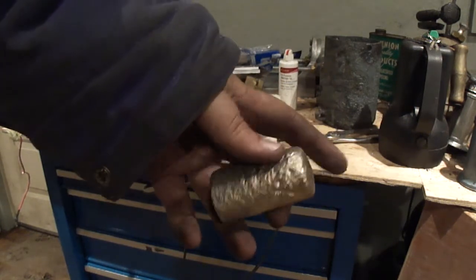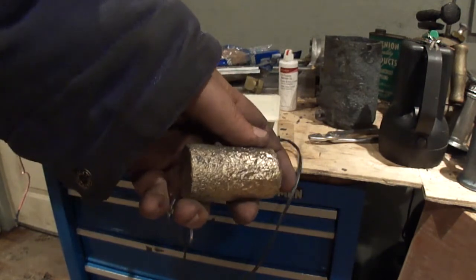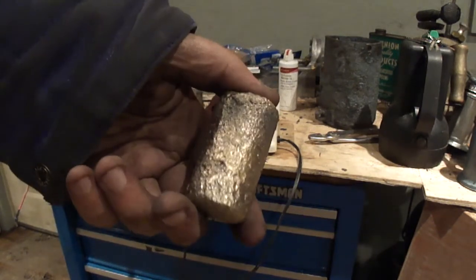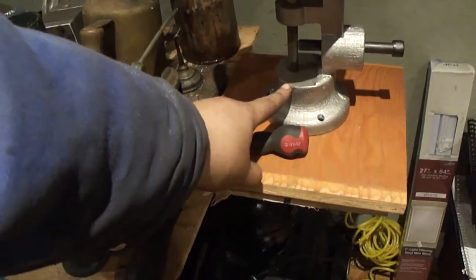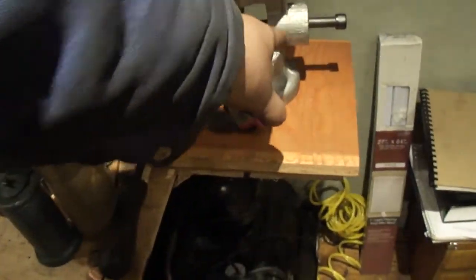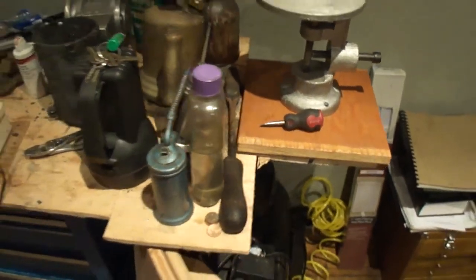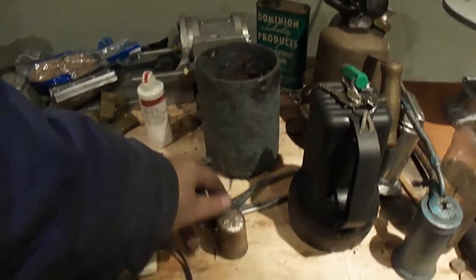I've got another crucible full of copper and everything measured out for another batch tomorrow if it doesn't rain — evidently the weatherman doesn't know what he's talking about anymore. We got enough bearing bronze for probably this part here and this part. The scraps I'll melt back down and make more rod for this one because there's a lot of extra waste. Thanks for watching. See ya.